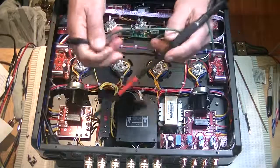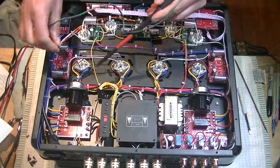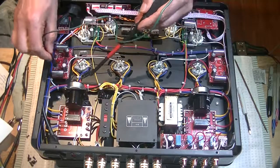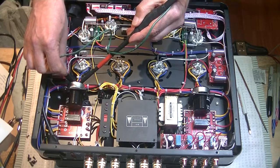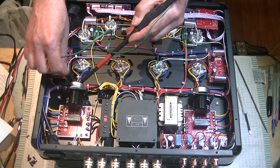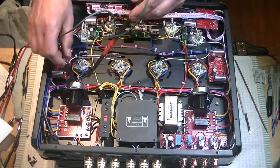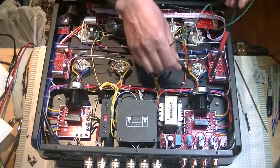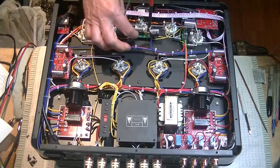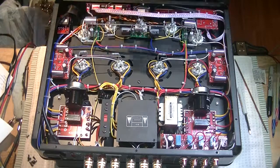Now Blue Glow has a fabulous video on how to make one of these things. Basically you just come in on the positive and negative of your biggest capacitors. You'll get a little spark. That's normal. That's just the energy snapping onto the short here. Remember, you're shorting out your capacitors in a controlled fashion. So the positive side is grounding out through your tool. So do them both. You can do some of the smaller ones. Go back with your voltmeter, check it again to see if the voltage is safe, and then you can proceed.